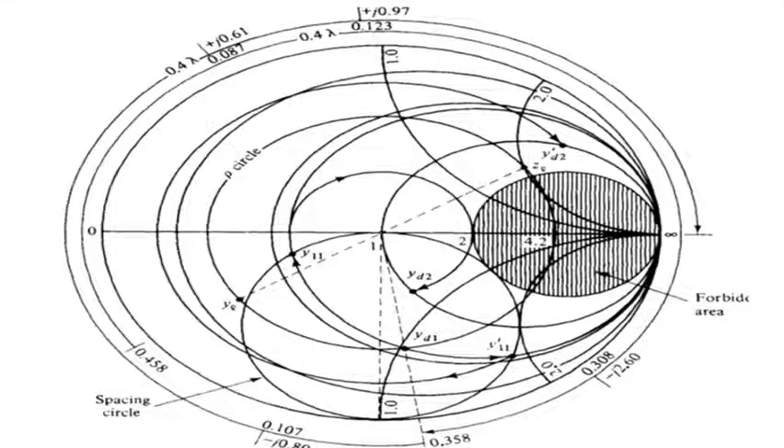For your reference, this is an animation showing how it looks on the Smith chart. I will show different colors so it becomes easier to follow. We are going to have YL. We are plotting admittance. That circle is called the VSWR circle. They have plotted this circle, and this is ZL — see the way they have drawn it going down to become YL.